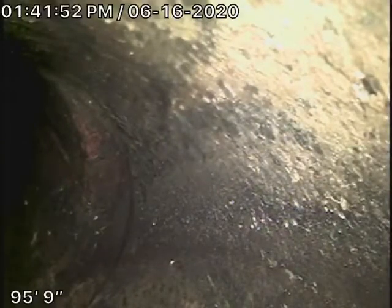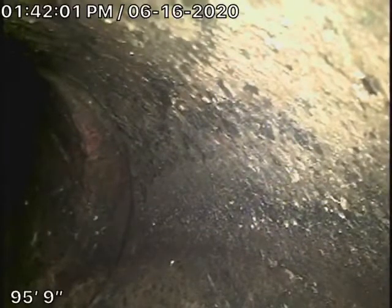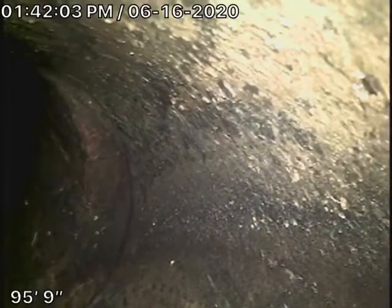Apparently there is a bathroom added on behind us that there's no vent for, so we cannot check it. We'll try the 2-inch over there, but your general inspector is going to crawl under the house to check that everything's done properly. We cannot check every pipe in the house — we check what's available for us to put our camera into.